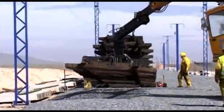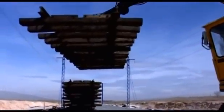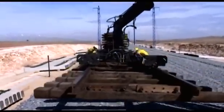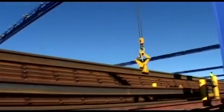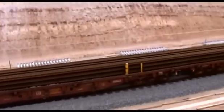This auxiliary track is mounted in 12-metre-long pairs with sleepers spaced at 0.80 metres instead of 0.60 metres, so they are manageable. This operation is getting more and more expensive due to the lack of second-hand materials on the market. When using the traditional system, it is necessary to mount a 4,500-metre auxiliary track in order to allow the unloading of the track train, which transports 30 long welded bars, currently 270 metres long.